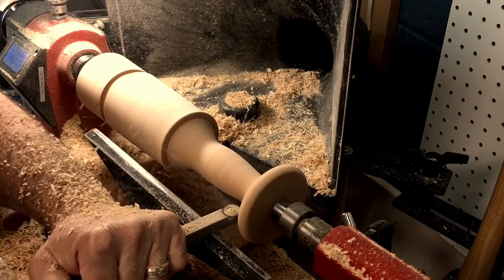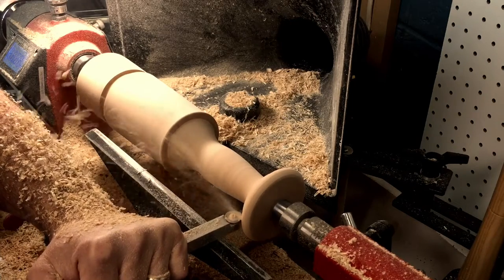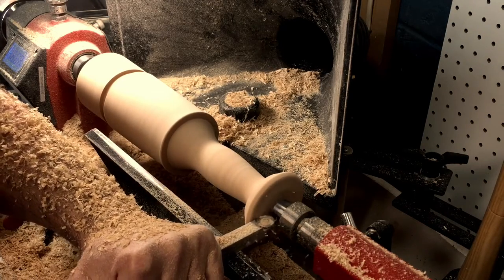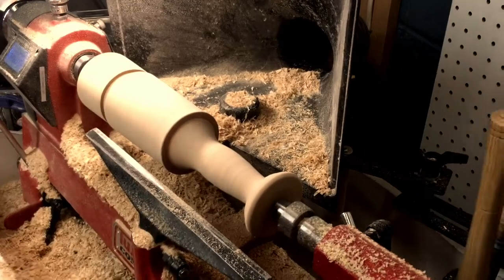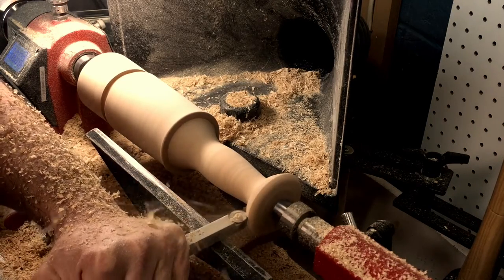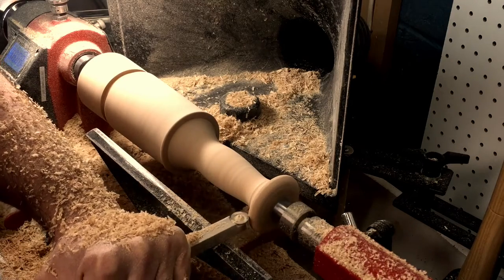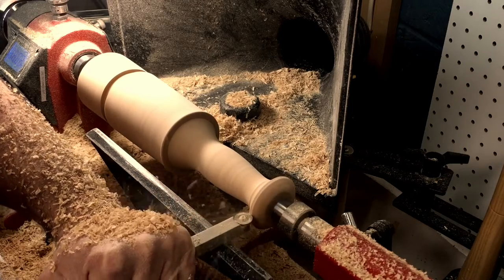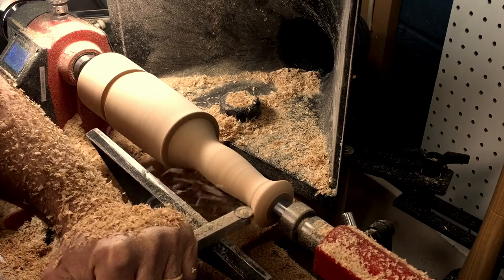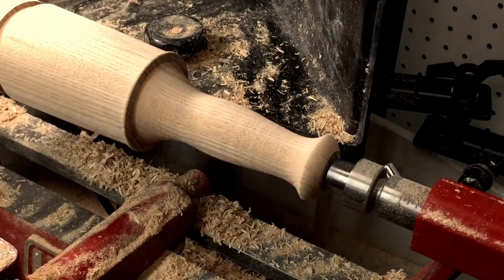Now I'll just finish up the end cap — I'm going to make it round on the bottom with a slight taper on the inside and blend it in with the hand, so the back of my hand will sit nicely in the curve. I'd also like to mention that I'm going to leave the hole or indent that the live center from the tailstock leaves on the end of the mallet. That way, if in time I need to do maintenance and clean it up — say if it got really nicked or chunked — I can re-chuck it on the lathe and it'll be easy to find center again.